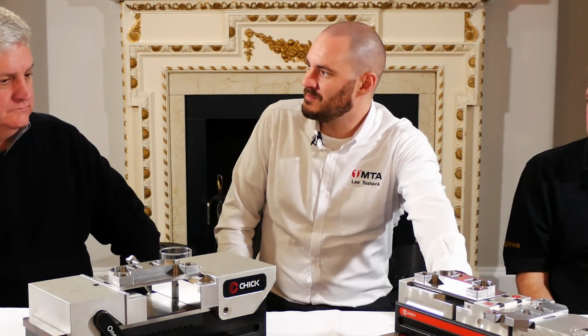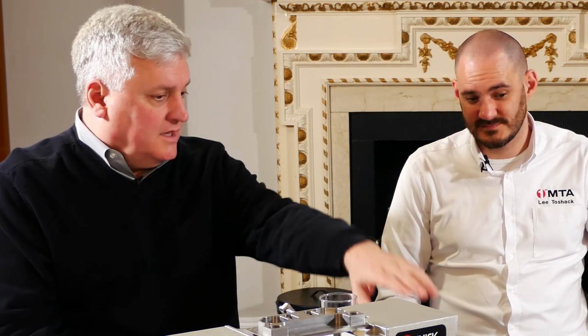Well, what is it that this is mounted on here? That's called a foundation. Chick has to come up with a design of an M12 50mm hole spacing on a common grid. They're designed specifically for the machine that you're working with to maximize the work envelope utilization. And literally, you can take on and off that quick lock and put it in the exact same location, just like you would if you were playing Battleship, let's say.